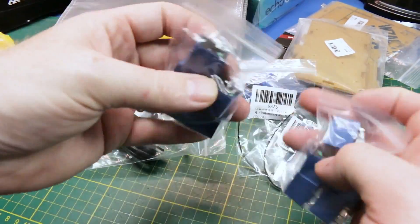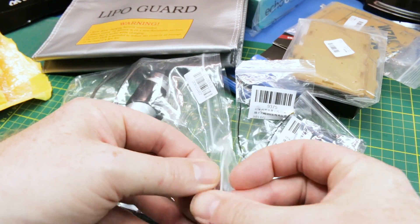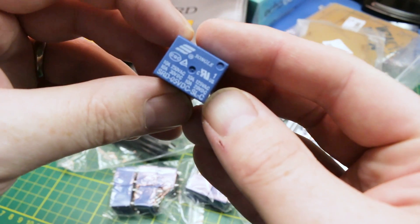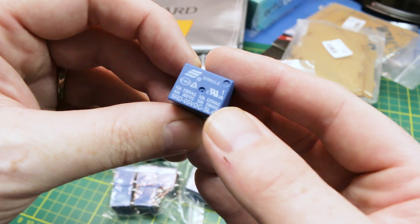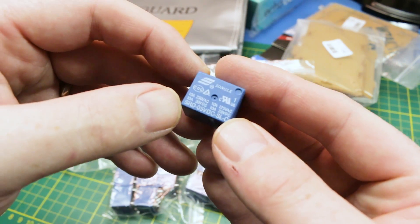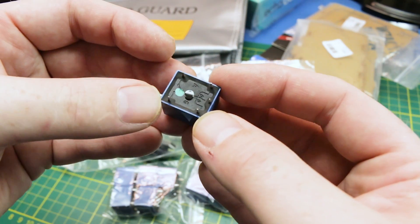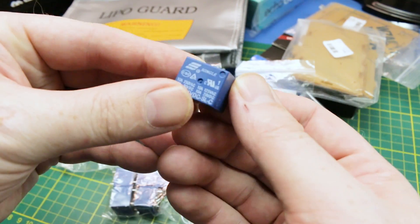In this package, a whole bunch of relays. I have lots of relay modules for the Arduino, but I didn't have any standalone relays for actual custom PCBs. So these are 250-volt rated, 30-volt DC, and up to 10 amps. Lots of current capability — pretty standard normally open, normally closed connections, and then your two coil connections. Nothing to it.